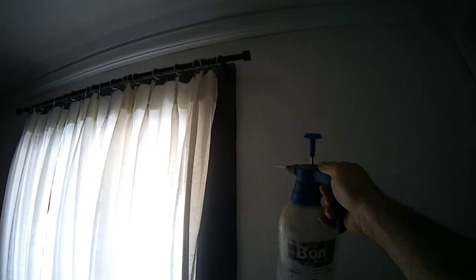There's a gap in here — you'll feel it coming in around there. So we'll go around this with some finished plaster. You could probably do it with caulking, but I want to do it with the finished plaster so that way it stays consistent color-wise. We'll go around and take care of those kinds of places while we're plastering up.